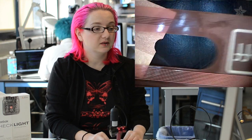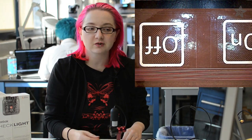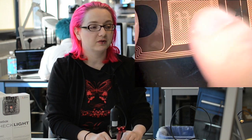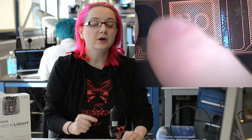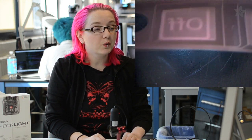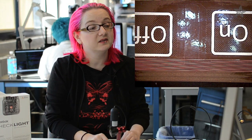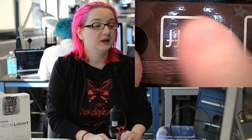Moving down to the buttons — this is the on-off button, and the on-off buttons are capacitive buttons, which is very interesting. If you flip it over, you can see the mesh that forms the capacitive touch electrode. They don't use a separate capacitive touch sensor chip; they use the microcontroller's analog input as a basic capacitive touch sensor. It could be for cost or simplicity — no additional component that could tear off the FPC — and nothing sticks out to irritate your head. The flex PCB itself acts as the button.